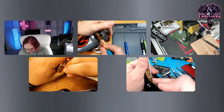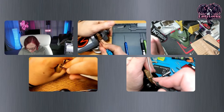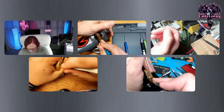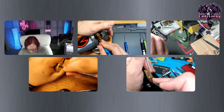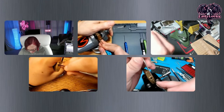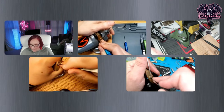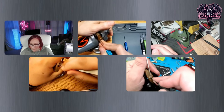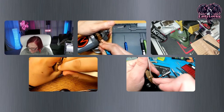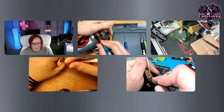I've thought a lot about why that happens. It could be that a pin has little imperfections on its cylindrical shape — or dirt or dust on it — and that little point which needs more room will cause every other pin to drop. That's not the normal way the lock would act, but if a pin can have a little thing standing out and you push it down with nothing binding, at a certain point it wants a bit more room and every other pin will drop even if it isn't set. That said, I don't think it's a pin deformation because the same thing is happening with my other Ace 38 — so I think it's a me thing, not a lock thing.